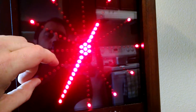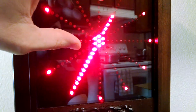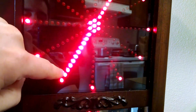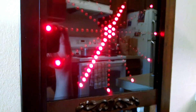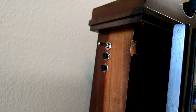There's a decoder board up here that converts all of that to the LED display. The reason I need this decoder board is that the inner LEDs on the clock face turn on when either the hours or minutes hand lines up, but the outer LEDs only turn on when the minutes line up. Hours and minutes are tracked separately, so it's a logical control to make the display look correct.